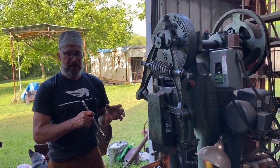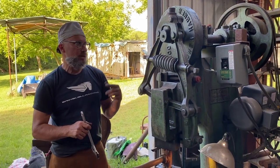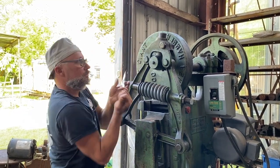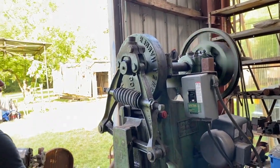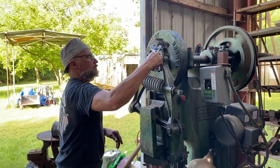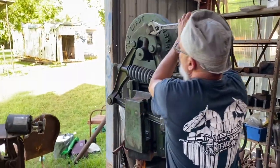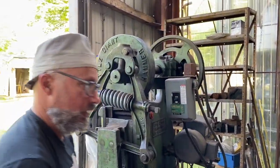You might have seen that I had a little bit of trouble getting the hammer to rotate because I had the pitman set low to draw, and now I'm going to raise the pitman, and on the crosshead, you have to loosen the crosshead. And you can use the power of the hammer itself to bring it up on the crosshead. So now it'll forge the tooling more easily, but it won't hit the dies. So if I wanted to draw, I'll have to adjust it again.